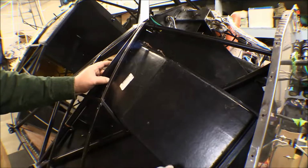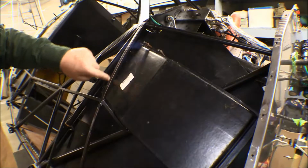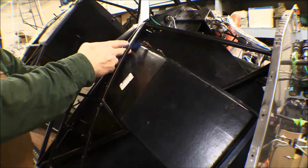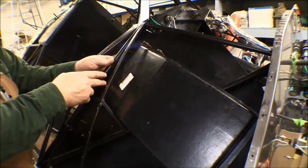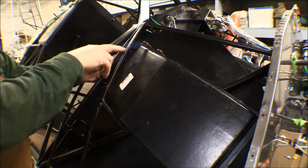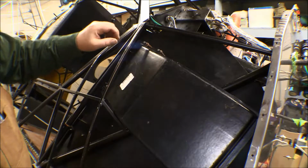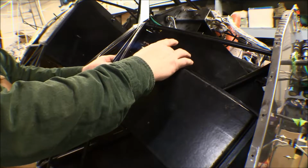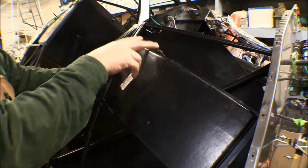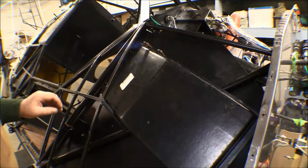I got this thing located, I guess, where it's going to go. I wanted to keep it back a little ways from this post here so the nut plates and stuff didn't rub on it, and I had to keep it back far enough to be able to get the drill in there to drill the holes. I got 2 holes there on the front, and they're a little closer in than the other ones were, but it shouldn't affect it any. And then there was 1 hole here all the way in the back before, 1 screw on both the top and the bottom. I put 2 up on this upper flange and 2 on the lower flange, and I've got it held on with clecos now.